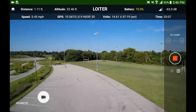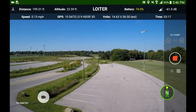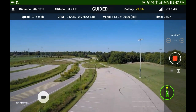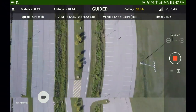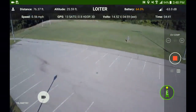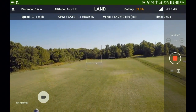Now I took control, and I'm going to push the button at the top left of the screen. It's going to change to a little image of a person, which is me — it represents the controller. And there, the home location is updated. Now I'm going to go ahead and push the return to home button. And there it goes — it takes off and flies right to me. It flew within about 10 feet this time. But I took off and started walking again, and notice how it changes the location as I walk. The home location is updated. So each time I tested it, it returned within 10 to 15 feet every time. So it's pretty accurate and it worked really good.